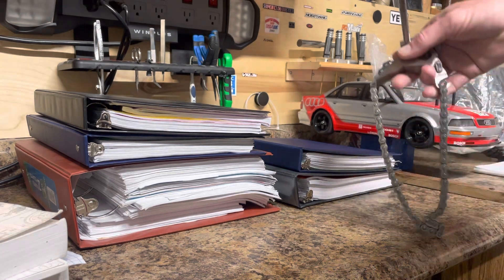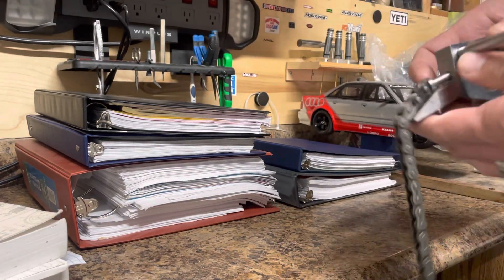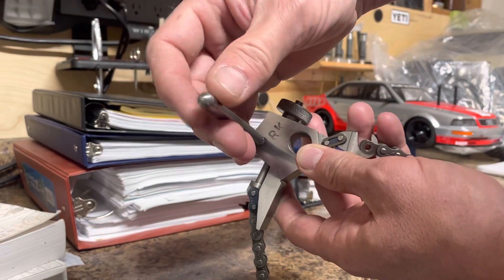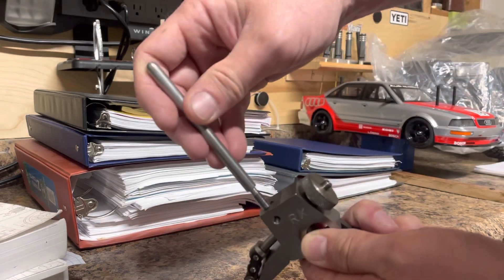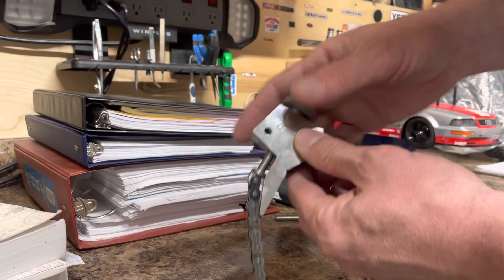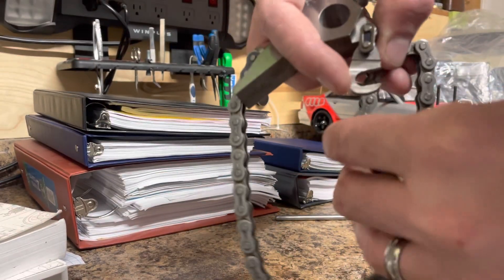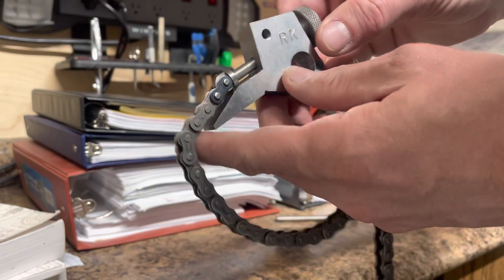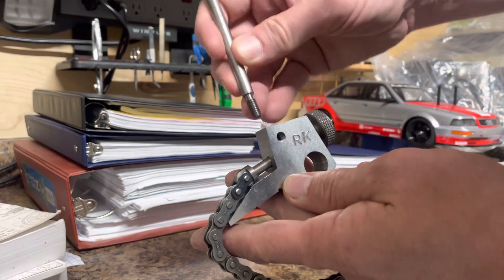Third level — I didn't do a video on this. This was the school I went to; this was your third level shop project. It's a clamp — a dial indicator clamp that you make — and your dial indicator would clamp onto this. It's threaded so you could put it on either side of the clamp or even up top here. You've got to make that little hook and basically wrap this around. Your couplers are used for alignment — you can just feed the chain through there, and then when it's snug, tighten this up and it clamps, and then you just mount this wherever it needs to be.